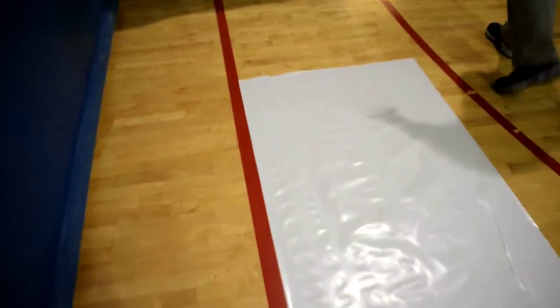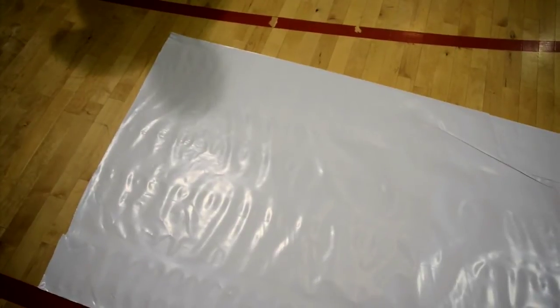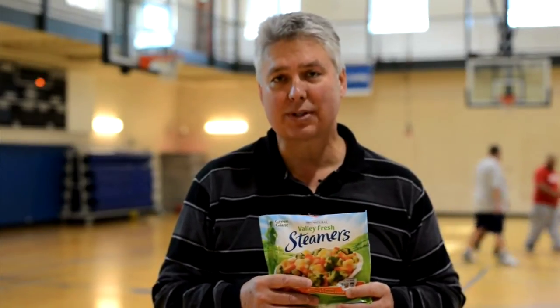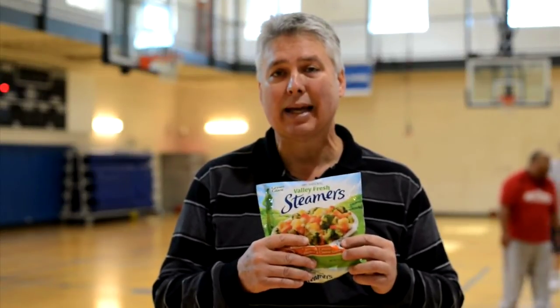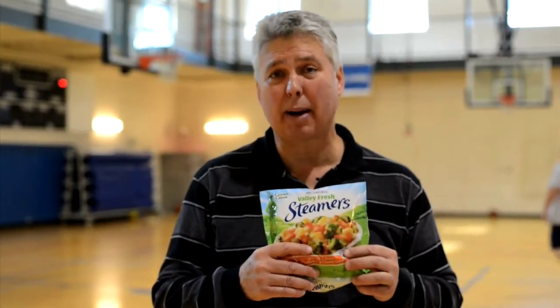When the film is just sitting here by itself, completely relaxed, if there's any dishing it'll show up like it did on the blue roll. The graphics and flexible packaging are more sophisticated than they've ever been. Printing presses and laminators are running at faster speeds than ever as well. This particular package was probably made on a 10-color press, which means it would have 10 printing stations and would run at about 1000 to 1400 feet per minute.